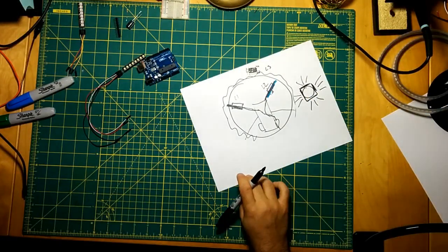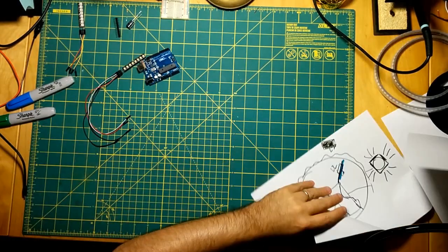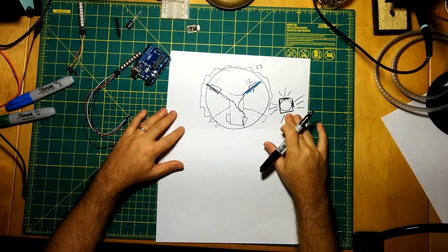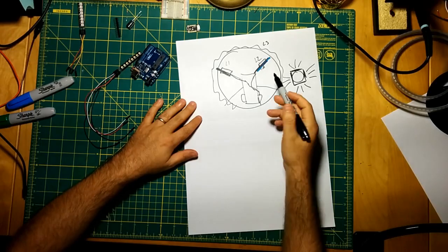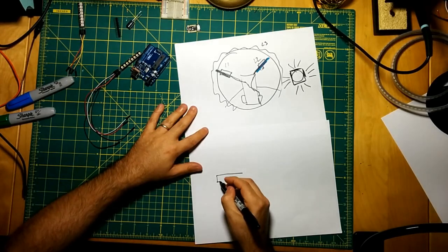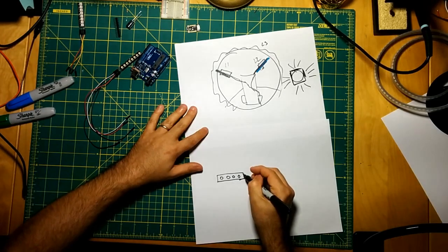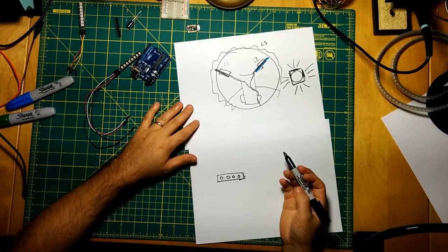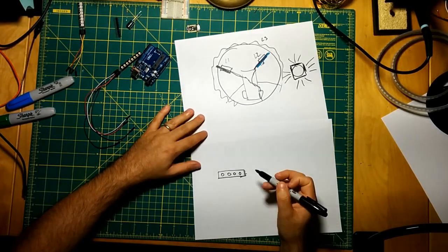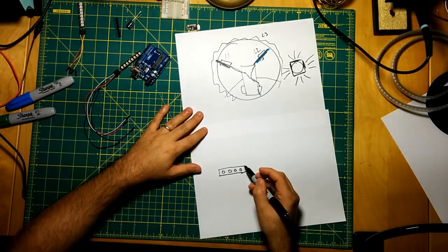This is the wrong view. So the idea, let me start the paper here. The idea with this section would be that you would obviously be required to have this front panel, but from a wiring perspective, you have your LEDs and your 4 contact pins. Either we find some sort of JST connector that's really low profile, which I've been looking for, and you can get like 1,000 of those things for relatively cheap. And the JST connector would just patch onto the end of this.